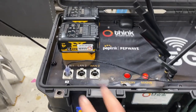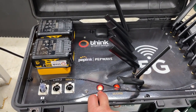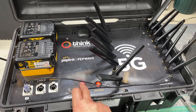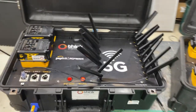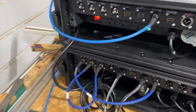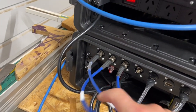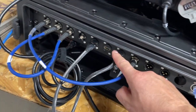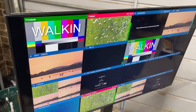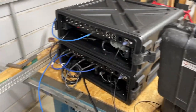As you can see on this one, it's got two LAN ports available plus another WAN port, plus the same battery backup system. On this one I managed to get the power to be a bit more efficient, and it runs for about 12 hours before the batteries run out. For this demonstration, I've got my return vision coming from my vMix control room and looped back into inputs, and I've also done the same with HDMI. On this rack I'm just sending a multi-view back, which producers in the venue might find useful to have.